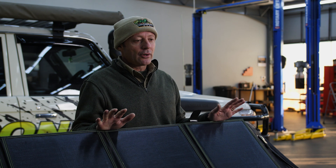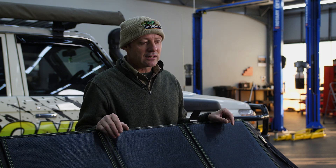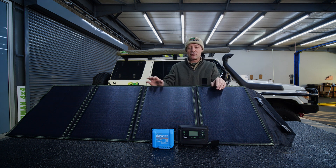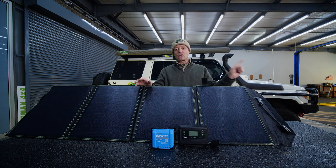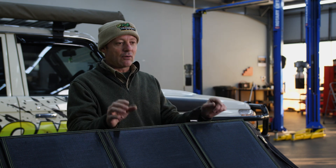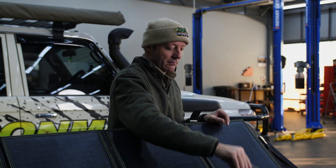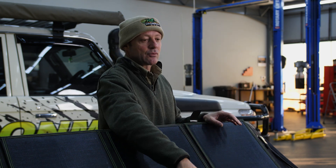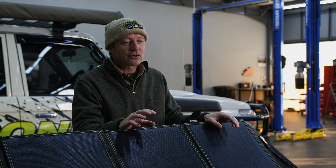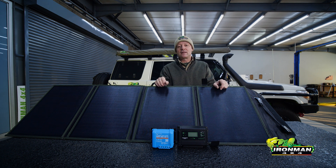This panel will only work when there is good sunlight. Typically, depending on where you are in the world, you'd get good sun from about 9:30 or 10 o'clock until about three or half past three in the afternoon — so around six good hours a day to charge your battery. Your battery is powering your fridge for 24 hours, but the solar panel can only replenish it for six hours. So six times six is 36 amps back into the battery using the PWM, versus 60 amps plus with the MPPT. If your fridge is running at two and a half amps an hour, that's close to 60 amps you're pulling out overnight.